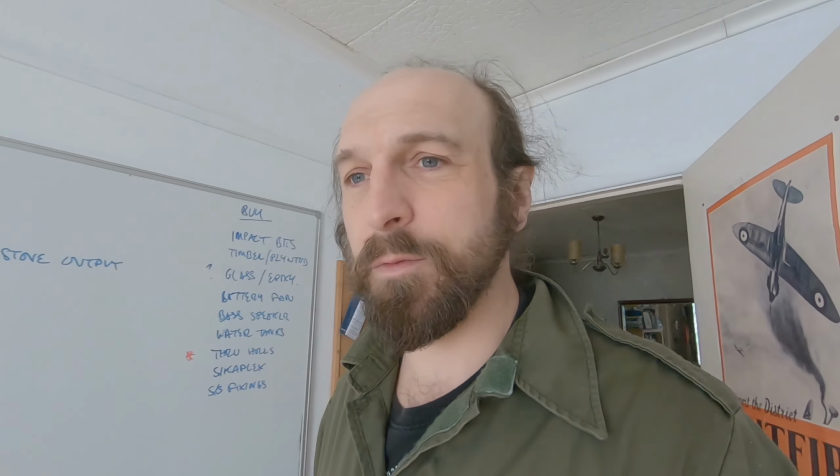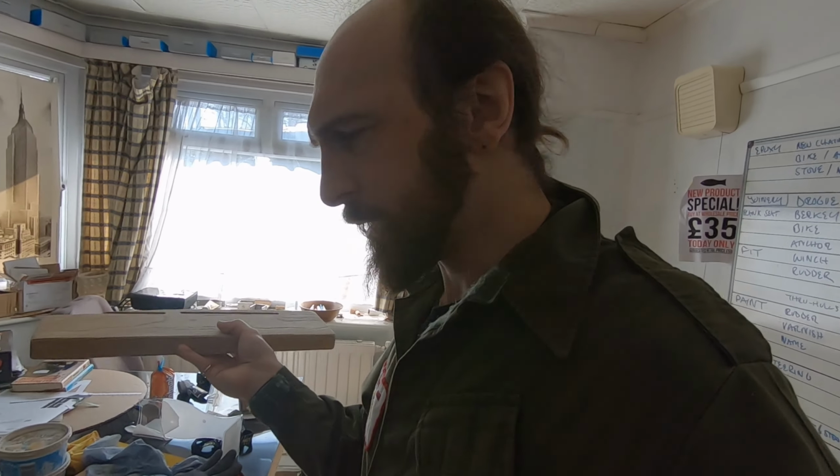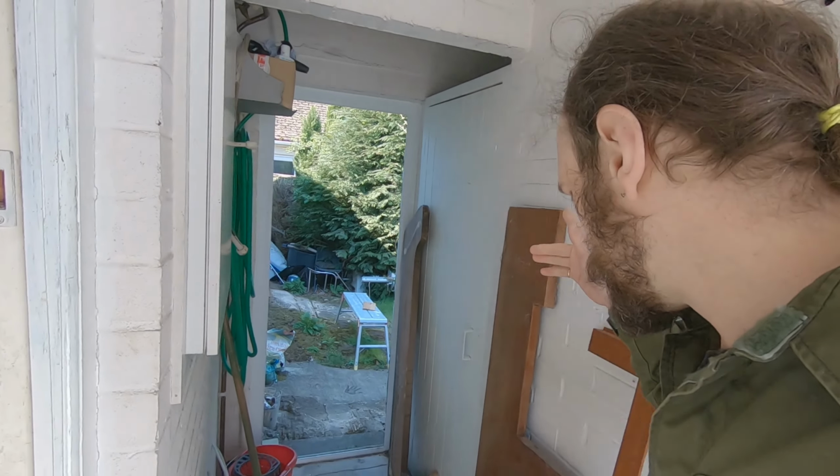So sensibly, then, now I am dealing with structural items which it would be much more sensible to have underneath the paint. And this is what this is. So this is the base for the fire stove to sit on. We'll have a look at that next week once I've stuck it in, glassed between a structural grid. Then I've got two anchors, not anchors, but back plates for chain plates. Well, they're sort of anchors for the series drogue safety device.